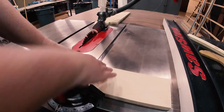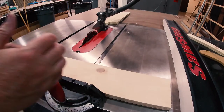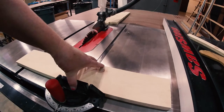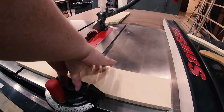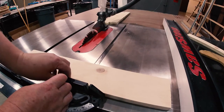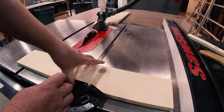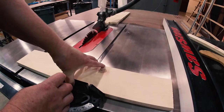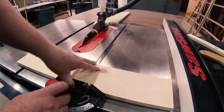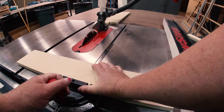Hold the lumber into the fence. I have three or four hand options: one is to hold the red handle and hold the lumber with the other hand, or I can do both hands on the lumber. What I can't do is not hold the lumber — if I don't hold it, it moves back and forth. The whole point is to compress it and keep it from shifting left and right. I can also hold it this way, which might be easier for the angle on this cut.